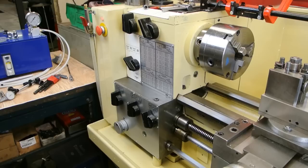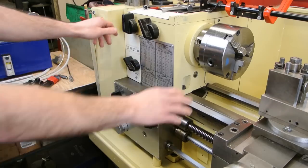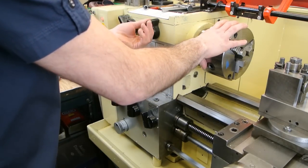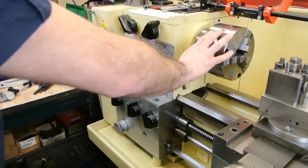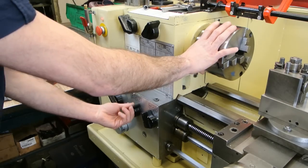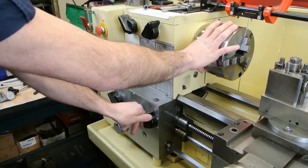When using a centre lathe with a Spraymist tank, you will first need to check it has a suitable speed and feed range. We will be drilling a 6mm bore, so we'll set this lathe at 1700 revolutions per minute at a feed rate of 0.025mm per revolution. Larger drills can be run at faster feeds. Our technical support is always available for any questions of this nature.